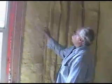Coming along the front of this house, there's a little bit of compression and a little bit of a void here. The installers had no idea there was going to be a specialty inspector out here looking at their install, and we have no idea how long these guys have actually been installing insulation. You can see I'm repairing it as I go — just pull it out a little bit, just a couple of touches to get it out into the conditioned surface.